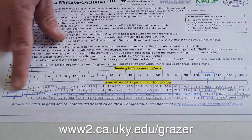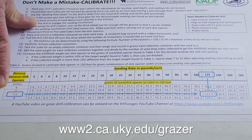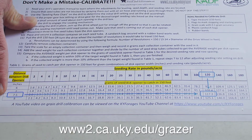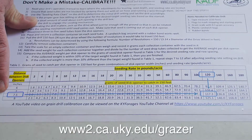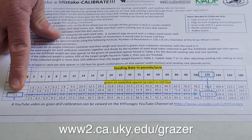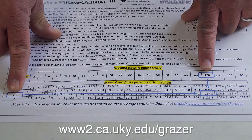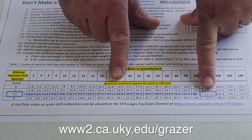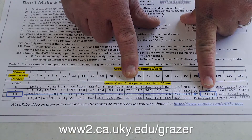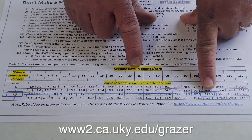The other piece of information we need is the disc opener spacing. Most drills will have disc opener spacings between six and eight inches. The most common is seven and a half inches, but it's important that you measure the disc opener spacing using the tape measure on the particular drill you're calibrating. We're using a drill with seven and a half inch spacing today and we'd like to calibrate it for 120 pounds of seed per acre — that's two bushels of wheat per acre. Following the chart, in 150 feet we need to catch 117.3 grams of seed per disc opener to achieve that target seeding rate.